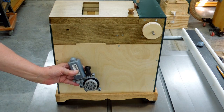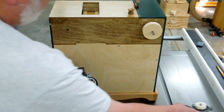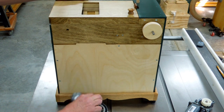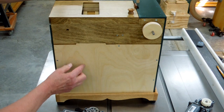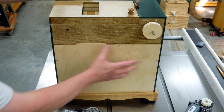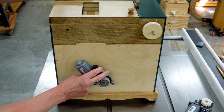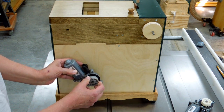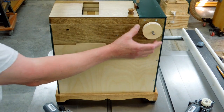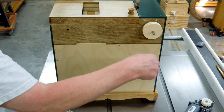This is a motor out of a window regulator for a car. Actually I have two of these — one's a left and one's a right — and I need to get this in here somewhere about in this position. In here there are usually three of the largest pipes for the organ that are mitered and curved around in here, and I'm going to have to change that configuration a little bit to give room for this. This will be sticking out through the plywood and there will be a belt drive that comes up to this, and this will be locked onto the shaft and attached to the cranking wheel.